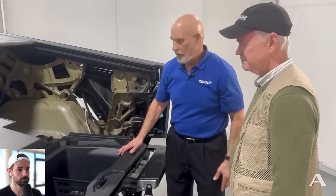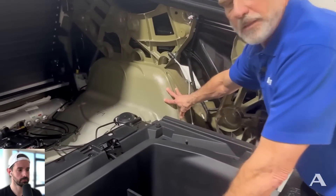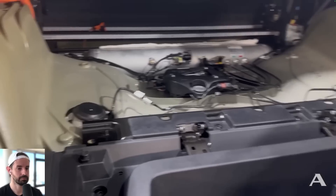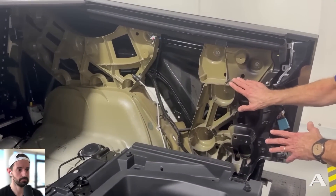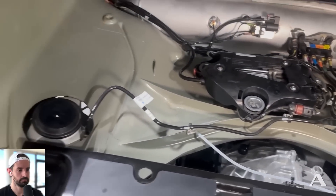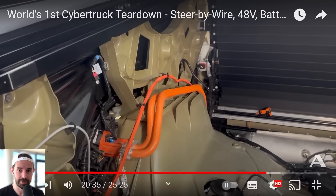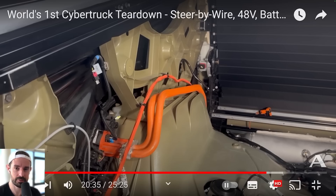The mega casting story continues to grow. You can see this very large rear casting — it's gigantic. No wonder they call it Giga. If you look at where they came with the Model Y rear casting versus what we're seeing now, it's huge. And then these buttresses — big castings attached to it — with all the structure going in this fashion. You can see the air cylinder for the air suspension here. The castings are painted, which conveniently lets you see visually, based on color, how much of this rear is cast — a lot. It's going to be convenient that Cybertruck is color-coded for assembly, with blue wiring for the 48-volt architecture and colored castings as well.